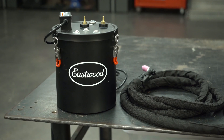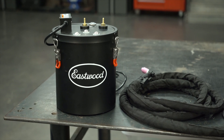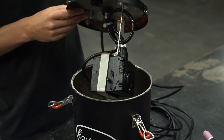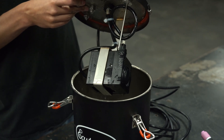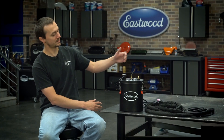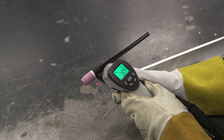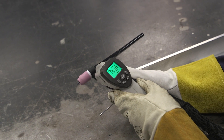So how does it work? Well, it's pretty simple and real easy to use, and it's perfect for our machines. We've got a nice stainless steel reservoir here that holds our mixture of coolant and water. It's got a pump that pumps the coolant and water out and into the torch, and the torch also has a return. So it's circulating that coolant-water mixture in this reservoir, and with this reservoir being stainless it also helps radiate the heat out. Using this setup, we see temp drops as high as 200 degrees.